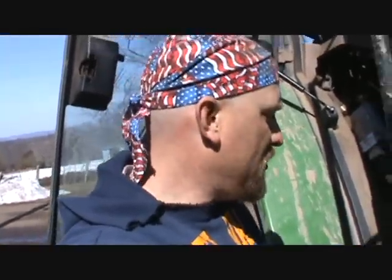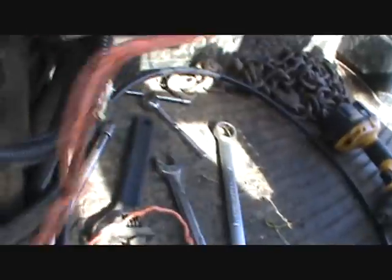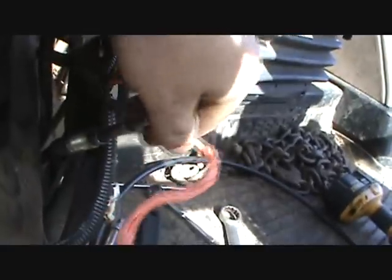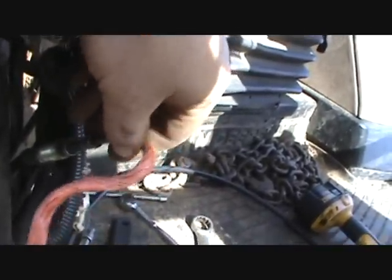I'm going to give you a little tip here on removing stuff from really tight places that you can't get your hands, or even see for that matter. Bailing twine — or any string. What I'm going to do is attach this bailing twine to this cable and tape it fast with electrical tape. So when I pull that cable out, I'm going to have the string in the same hole. Then I'll detach it from the old cable, attach it to the new cable, tape it fast, pull the string, and it'll come right up through the hole.